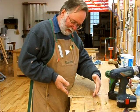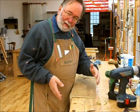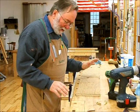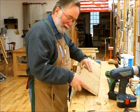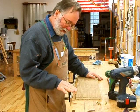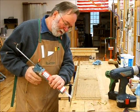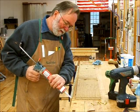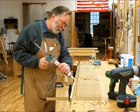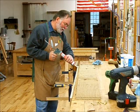I've cut four sides for the box. Each is seven and three-eighths inches, and assembled together I should end up with a total of an eight inch box on the outside. I've drilled holes every six inches along the length. This wood is pretty bad — a lot of voids — so instead of doing the tongue and groove I had planned, I'm going to do flat butt joints with construction adhesive and a lot of screws. I've got brass screws that will withstand the moisture. I've clamped the bench because this plywood is pretty warped, but once it's all screwed together it'll have the structural strength it needs.